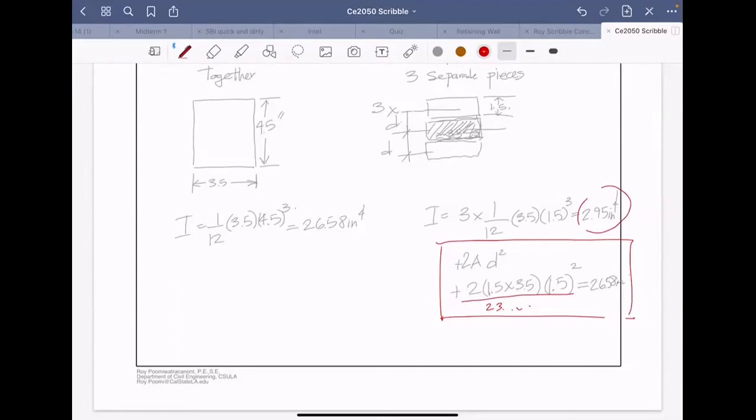So you take, what is that? The D is just a neutral axis between the two? Yeah, yeah. And so by stitching it all together, you take advantage of physics, the moment of inertia, specifically the parallel axis theorem, to get a higher moment of inertia. And when it comes to structures, having a higher moment of inertia is for the most part what you want. Okay.